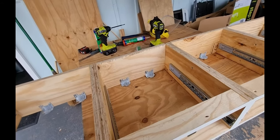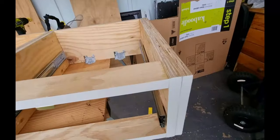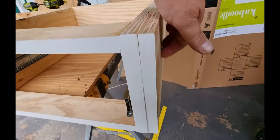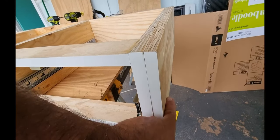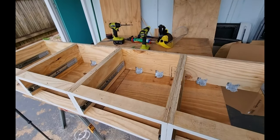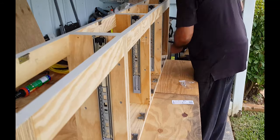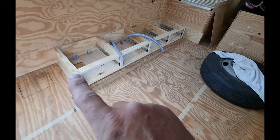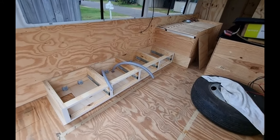Now I've got to work out the cabinets. The cabinets have got a side panel on one side and the other side there. I've got to put the end panel onto the cabinet and then see where it comes along the side here because I've got to make a piece to cover the gap. I've got to find out how much of a piece I need to make on both ends, then I can screw the toe kicks in and put the cabinets in. I'll work out the cabinet ends on either end and what needs to be done, then I can fix that down and put the cabinets on.